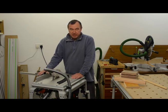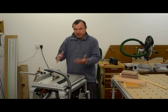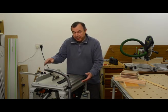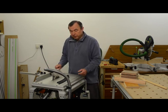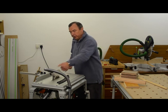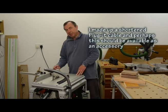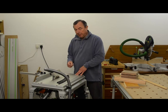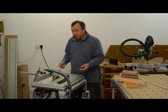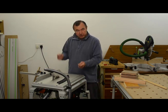First, I think the mains cable is slightly too short — it's 2.3 metres long. I can understand why, because the Festool philosophy is that you have your extractor close by, which is reflected in the length of the extractor hose in the extraction kit. But that's pretty minor. Changing the angle of inclination is a little tricky — you've got to undo the two clamps, and then in order to read the angle on the gauge you've got to look up from underneath, which isn't the easiest thing to do. But once you've identified the right angle and tightened up, the cuts are absolutely brilliant. So there's no issue with function — it's just how you set that angle, which is slightly awkward. I don't see that as a big issue.